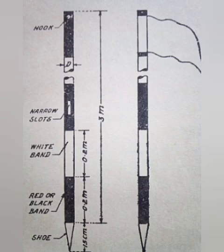Ranging rods are used for marking the positions of stations conspicuously and for ranging the lines. They are made of well-seasoned, straight-grained timber of teak, blue pine, shisham or deodar. They are circular or octagonal in cross section of 3 cm nominal diameter and shod with iron shoe 15 cm long at the lower end. They are made in two sizes, namely one of 2 meter and the other of 3 meter, and are divided into equal parts, each 0.2 meter long.